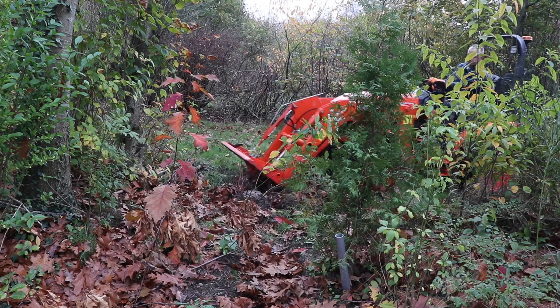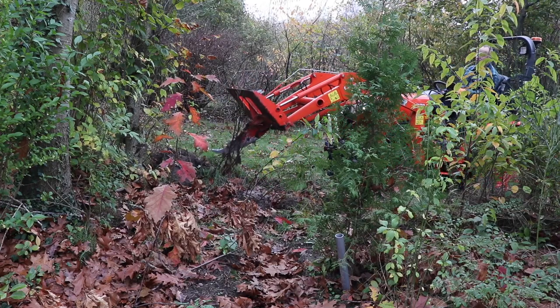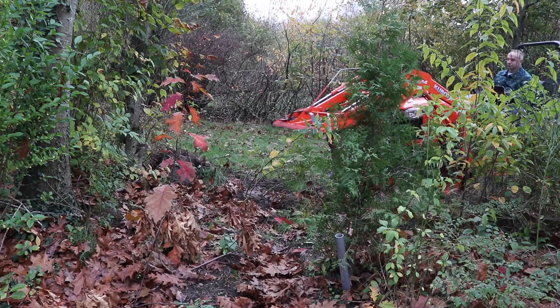And in this case you see that at this larger distance the ripper is indeed able to cut through this section of the stump side. This approach is then repeated for all sides to cover as much as possible the whole perimeter of the stump.